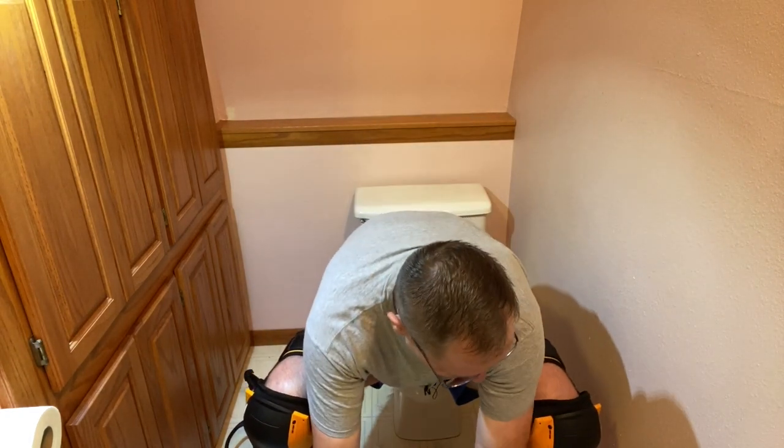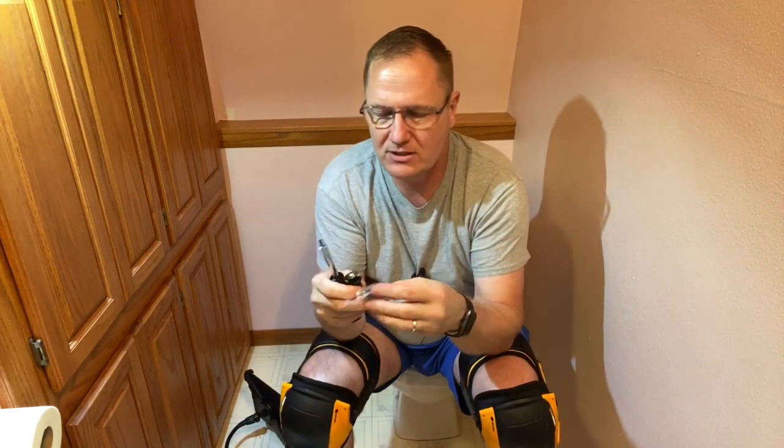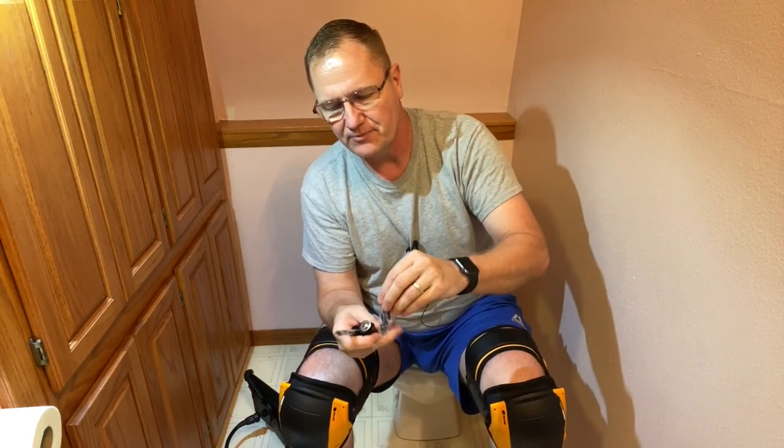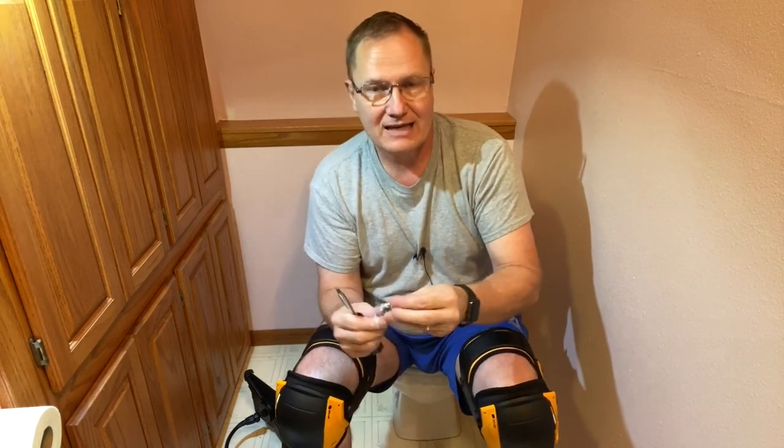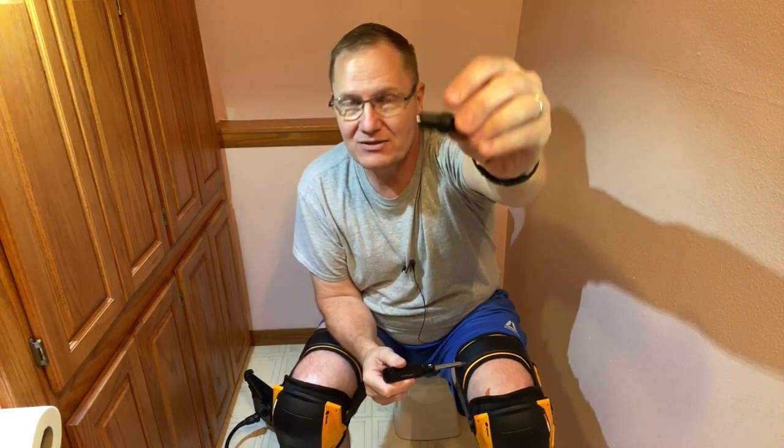Now let's take a look at what tools we'll need. First, we're going to need to take the current water line off and take the lid off. This particular lid needs a half-inch deep socket. Secondly, when we go to put the new one on, here is one of the little bolts we use to secure the seat. The one coming off has a metal screw part with nylon nuts so you can tighten it but not over-tighten. For the mounting plate, we've got a Phillips screw — slightly larger than a number two — so I grabbed the larger tip from my multi-tip set.